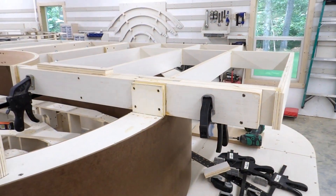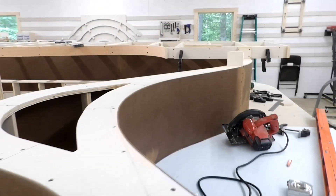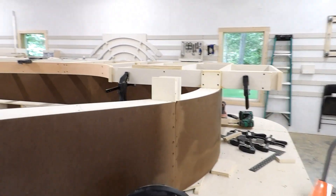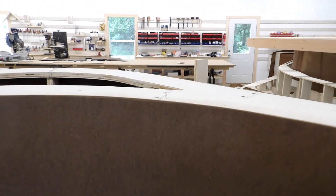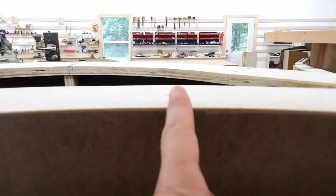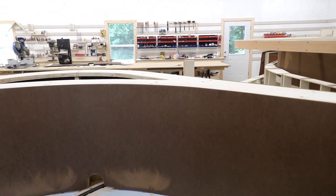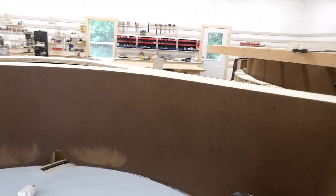With this corner piece being done still fairly early in the day I'm going to move right on with the next one. I have approximately seven feet of the peninsula still to go — actually it's seven foot one. So all things being equal it makes sense to do two frames about three and a half feet wide. Anyway, 42 inches comes to this line and that doesn't give me a very wide spread on the backdrop. So I think I'm going to make it a four foot frame, coming up to about here where the backdrop is twice as wide, and that will give me more stability at the point where it's easiest to screw it down. So I'm going to do about a four foot frame and then a three foot frame. The first thing I'm going to do is get a long strip of plywood temporarily positioned in approximately the right place, figure out the best way to frame this, and I'll be right back.